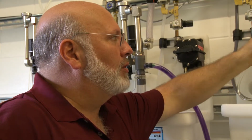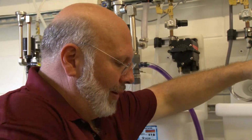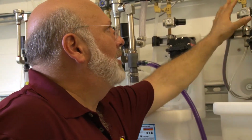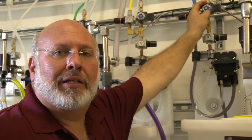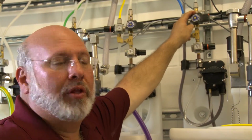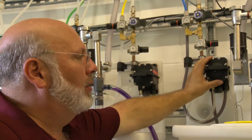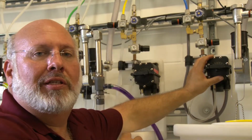So the chemical gets mixed from the hydrominder through the venturi and the small tip, drawing chemistry from a concentrated drum and mixing it in our tank. That product sits here until we activate the solenoid valve that'll power the flow jet pump. Solenoid valve is here. It's activated by the controller for every car that has wheels that it's going to get wheel cleaner. It actually opens the valve, allowing air to come down through this regulator, feeding into the pump, and control how much volume of product we pump through the pump out to the CTA.